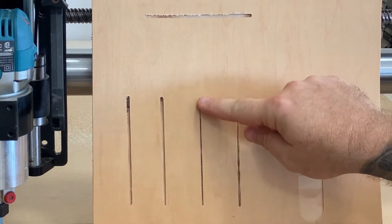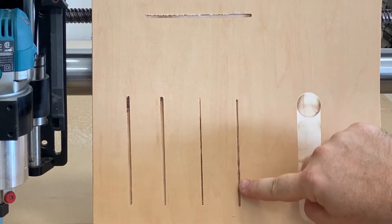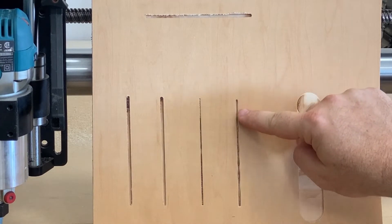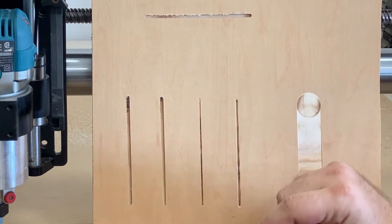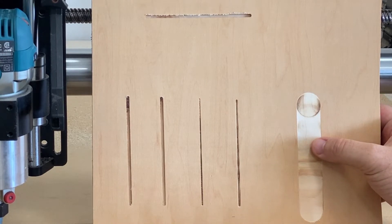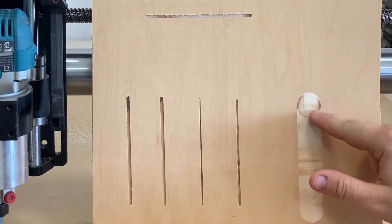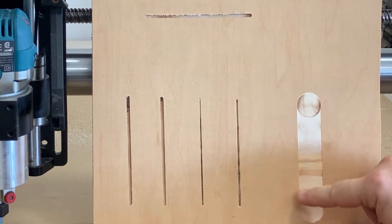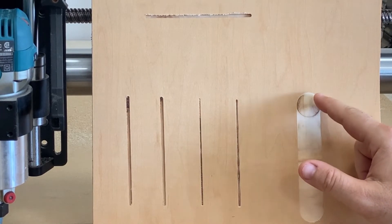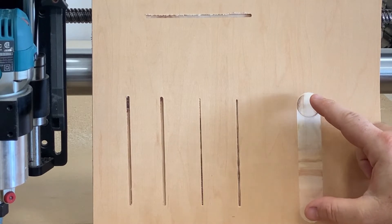Next, we have the 20 degree engraving bit, and this one creates a fine line and it's really good for detail. Now the 60 degree engraving bit creates a much bigger path, and we're really not deep enough to see the engraving, but it actually cuts at an angle. Then we move over to our surfacing bit, and here's where the happy accident came in. This is actually the first time that I'd used this bit — I bought it just so that I could experiment with it. But what you saw when we were cutting is that it actually burnt on both ends. That's because when it stopped, it burnt into the material right there. So before I actually use this bit in a real project, I'm going to have to research and figure out all the speeds and feeds so that I can prevent that from happening.